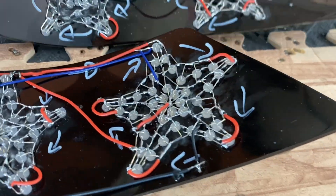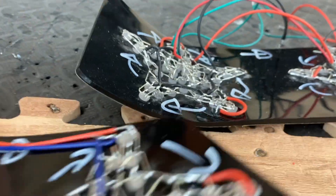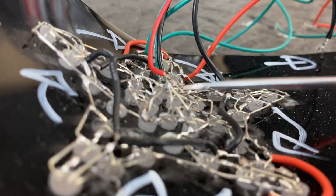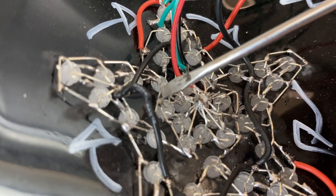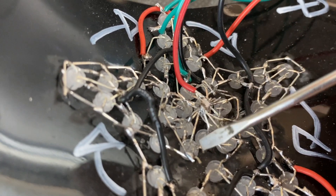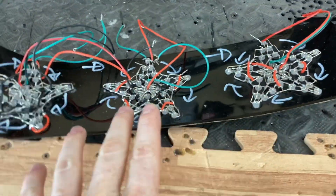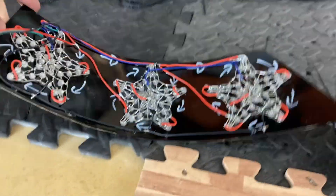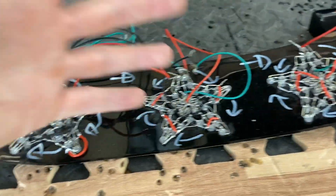You can really see the learning curve here — this first star is just a mess and this later one is properly cleaned up. Even how I ran the power for the first star: it works but it is hideous. I had to run the power up and into the middle because I ran the grounds and data too close together. Going through that taught me how to make everything flat and organized. I haven't completely finished this board yet, so I can still clean up the wiring a lot. You can see how I ran the power wire across the top and the ground on the bottom, with data going to each one.